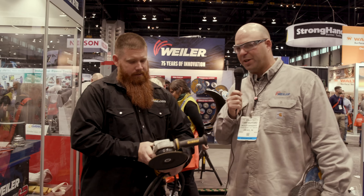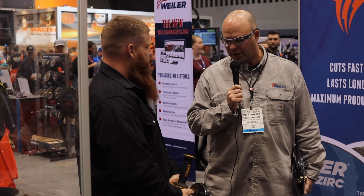Today I see you've got a Tiger Pipeliner grinding wheel on there. So we're going to be talking specifically about multi-pass welding. The first pass after the tack is the root pass or the bead, and we're going to talk about grinding the bead. Something special about this wheel is it's specifically designed to grind that bead the way everyone wants it to and to last a long time. It'll also do the different functions you need — facing the land and grinding the bevel as well.